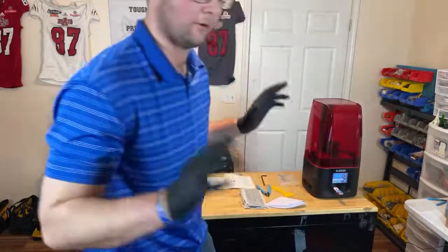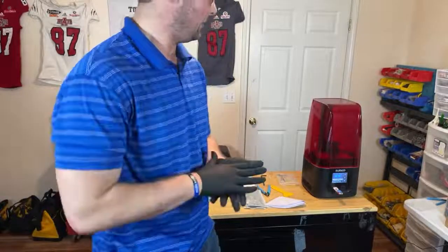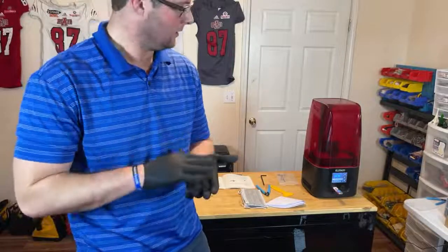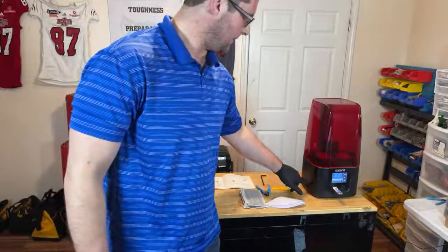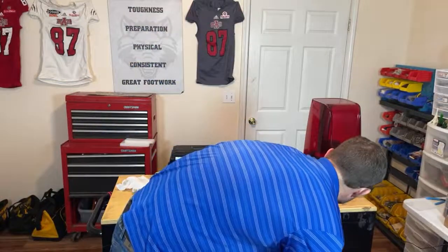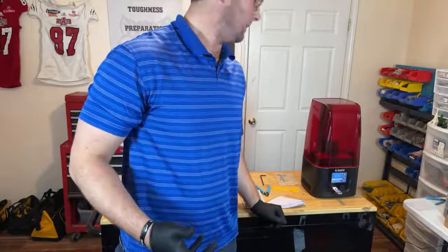Yeah, two circles, that's perfect. So when we're printing the Rooks, it's just a circle. And to talk through some of the fundamentals of resin 3D printing, it just goes layer by layer. An entire layer gets cured at a time. You can see the UV lights on down here. And so we'll just let this cook, and it has a projected time of 2 hours and 17 minutes.